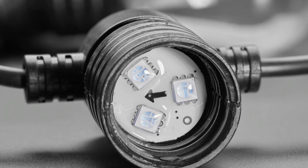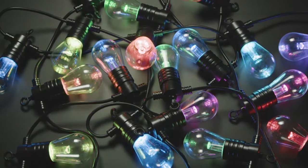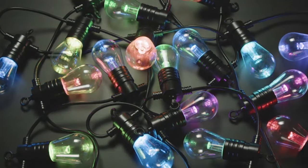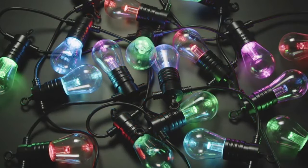One thing is, because there's three LEDs in series, you need to use 12 volts to power them. Also, because the cable runs are going to be so long, you want to have a high voltage. So you can't run them at 5 volts, you need 12 volts power. And the signal needs to be 5 volts. So if you're not using a 5 volt level shifted output, you'll need to shift your output to clean 5 volt levels, because they don't like 3.3 volts. They're very picky.